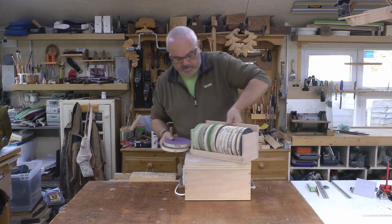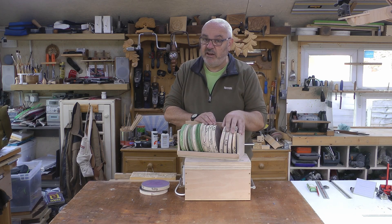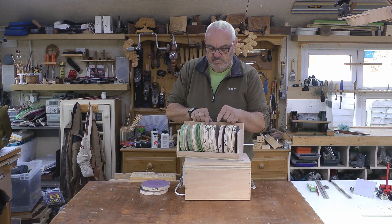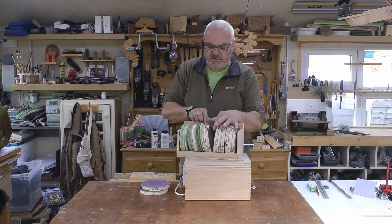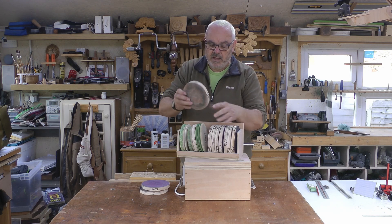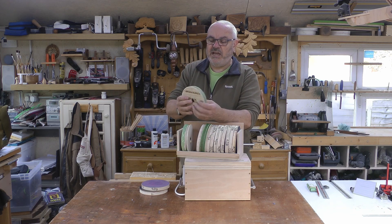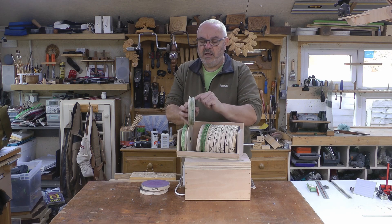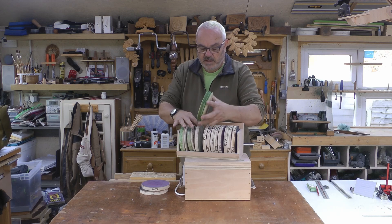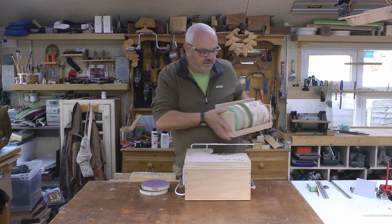As you can see we've got 80, 150, 180, 220 grit sandpaper, then lapping film — 60 micron, 40, 30, down to 15 microns. So this is very much based on the scary sharp system. I've also got a few discs here that are shaped — this is actually tulip wood rather than plywood — shaped to take carving gouges, and this one for V-tools. So I'll show you that in due course. It's very quick and easy to change the wheels.